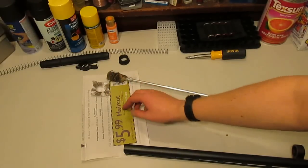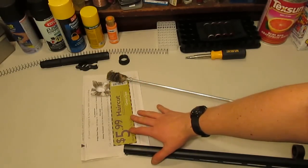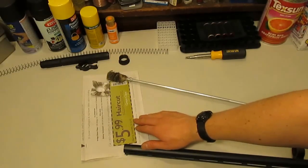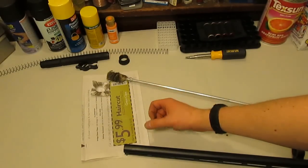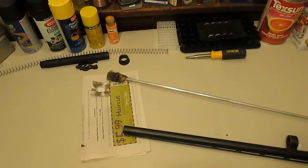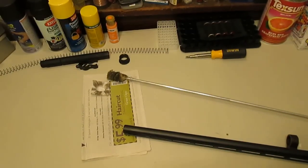But while lead is toxic, it's not radioactive. Inorganic lead is not readily absorbed through the skin, so it's safe to handle. And most cases of lead poisoning are due to long-term direct exposure, so a minor slip-up once in a while isn't something to freak out about. Just be aware of the dangers, know how to safely handle it, and use a little common sense.